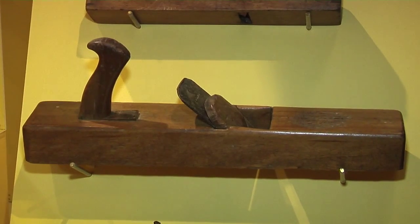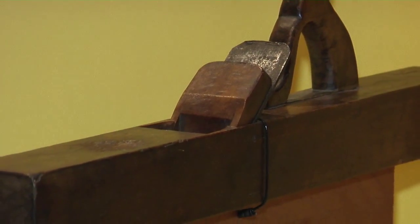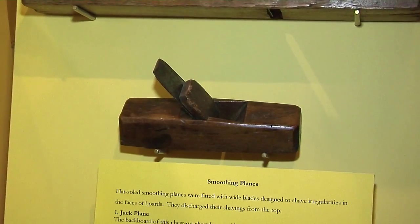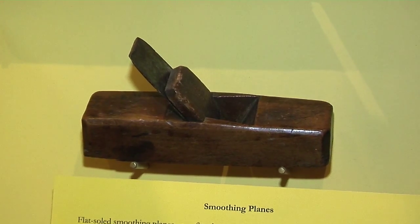It left slight undulations, but it was very smooth and didn't need to be sanded. The joiner plane was used to straighten the edges of the board so that they were square and would butt together tightly. And the final plane was the smooth plane, which was just used to touch up and smooth the surface, and used for fitting boards together.